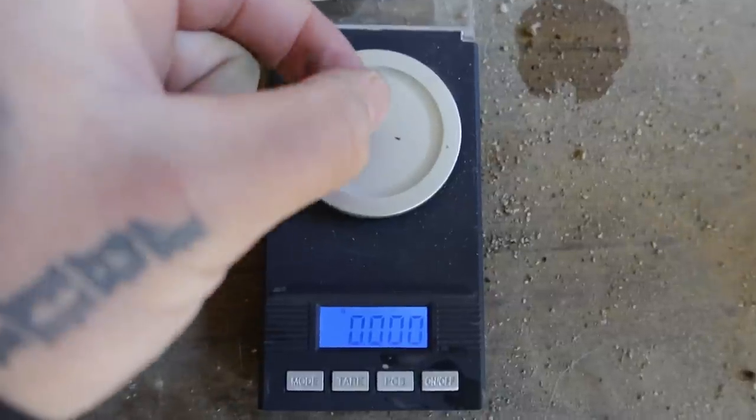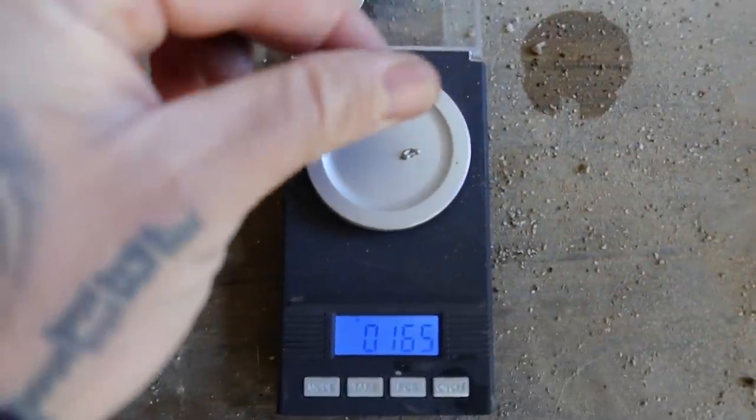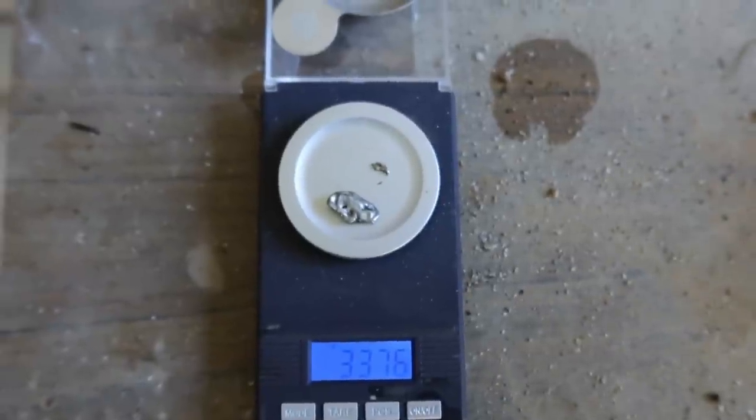Now we're going to put this gold alloy on the scales and see how much we got. We know we've burned off a lot of impurities - the sulfides would have literally oxidized and evaporated away - so we won't have the full 3.8 to 4 grams of gold we put in. A tiny little bit broke off at 0.165 grams, and now the big chunk: 3.376 grams. That means we burnt off almost half a gram's worth of impurities, and our gold ore is mixed with galena, which is a mixture of lead and silver.